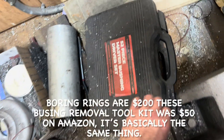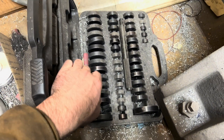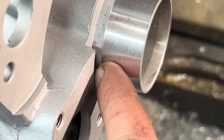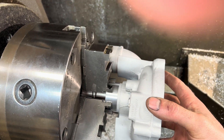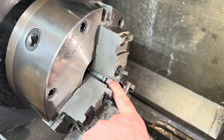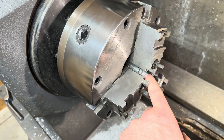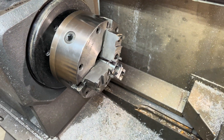This is a look at all the boring rings that I created. I want to show you this — it's a 52-piece master bushing set. This is absolutely perfect for cutting any size bore that you want. I took my 3/8 boring bar and just went over and surfaced it — we had to cut about 10 thousandths off that. I put this in the jaws and then took it back out. It's a little bit bigger than what I need, so the way to handle this is I need to put a little boring ring in there. I'll take one from my set — grab one that's going to be a little bit smaller than this, and cut these smaller than that part to make this accurate when we go to cut it.